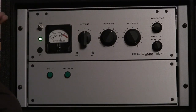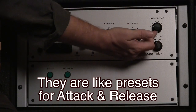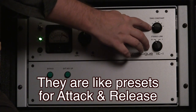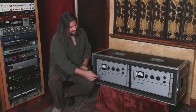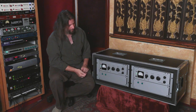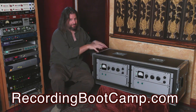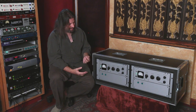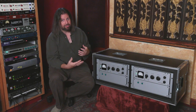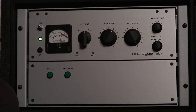What you've got here that's kind of unique to this style of compressor is these time constants. You do not have tweakable control over the attack and release times. Lower numbers go to higher ones — generally, these are the faster and these are the slower. When we're talking about the release times, at number one we're talking in milliseconds, and if we go all the way over, we're talking release times in the neighborhood of 20 to 25 seconds. That seems a little bit crazy, but in the 1950s when these things were being designed, they were getting applications for orchestral recording and radio broadcast, so those aren't crazy times. But most of the time in rock and roll, we're probably going to be in one, two, or three.